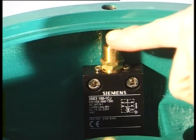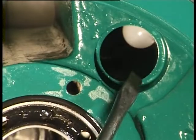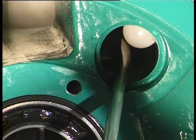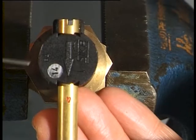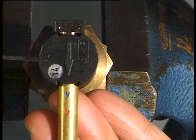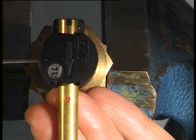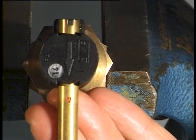Check the hood limit switch for damage and functionality. Check the float switch for damage and functionality. The thread of the float switch is glued in with Loctite 245. Undo the lock screw to adjust the switch unit. Displace the switch unit until the blue tip of the arrow is maximum 1mm visible at the inlet of the guide of the desired switching contact NC. After adjustment, re-tighten the lock screw.